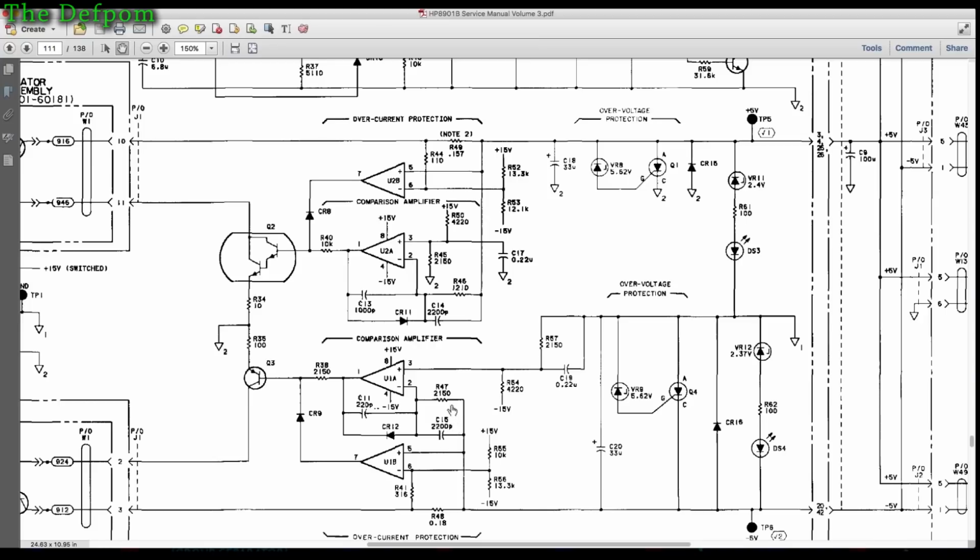So any slight variation in voltage is going to be due to these voltage dividers here, or the feedback here. Or possibly aging of this diode, or one of these caps might be aged slightly, which may be dragging the supply very slightly as well. So it's probably just these voltage dividers have gone slightly off value. I'm not overly worried, to be honest. It's just very slightly off, just a smidgen. There's really very little in it.